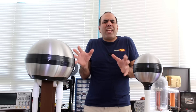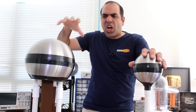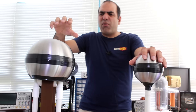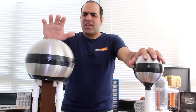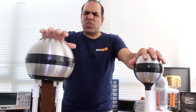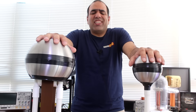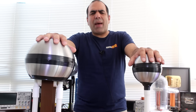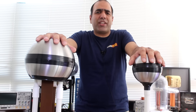I may not have much hair on my head to offer, but I have a whole bunch of glorious knuckle hair. So the dome might originally be at 300 or 400,000 volts, but as I bring my hand close, it sucks the charges from the dome and the voltage drops — lower and lower. At this point the voltage across it is zero, because the amount of available charges is so low that even my body can short it out.